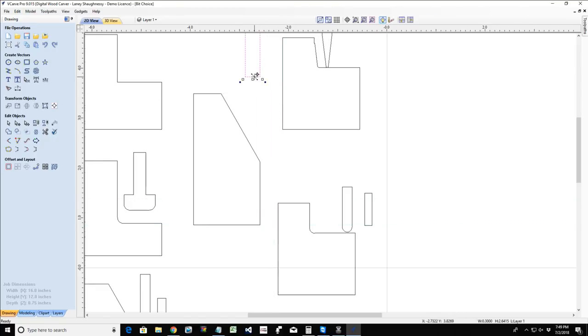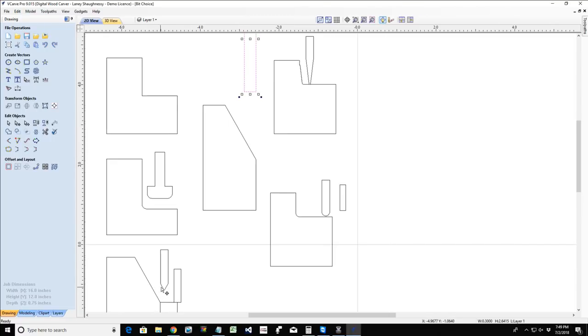And then my other cut is going to be a profile toolpath, because I'm still following that same line, but it's going to be a V-bit that I'm going to be using to create that angled cut. Now, of course, let me size this V-bit up to a more appropriate size to represent this a little bit better, because our chamfer wouldn't be that huge. Bear with me a second. Get in there now. I want that chamfer cut, so I'm going to create that nice chamfer, that nice angle, and let's draw this out so it's actually more appropriate.